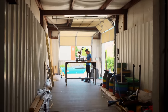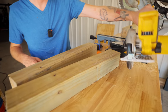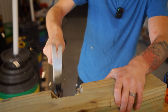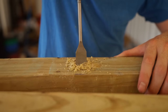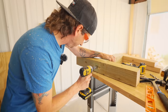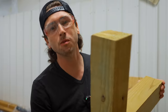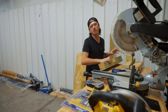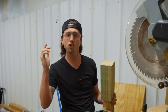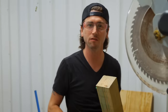I want to quickly walk you through what we've already done with the legs. We made our measurements, took the circular saw, cut that out and removed the gap. We then stuck the upright in there, took a paddle bit, and drilled out the holes so that the screws actually sunk in. I do recommend using at least two bolts in there — if you have one it's just going to be a little rickety. Next we need to finish this second leg and then jump in to building the frame that your top and pad is going to sit on.